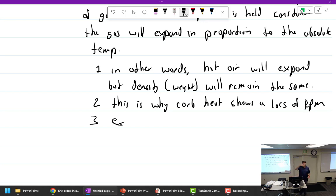So it's got a plunger and a tube, and you take a piece of cotton and you put it down in there, and it's like a primer. If you push on it real slow, nothing happens. But if you slam it down, the cotton instantly ignites and burns up. It's really cool. You have to slam it down because if you do it slow, the theory is that the heat is still there, but it's escaping through the plexiglass sides at a rate fast enough that the inside doesn't get hot. But if you slam it down, it doesn't have time to dissipate the heat, so it burns up the cotton. I'll have to get one.